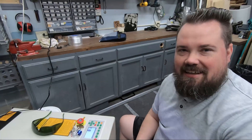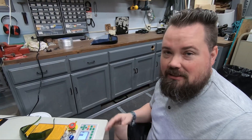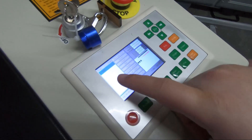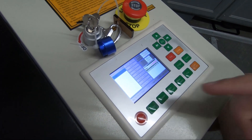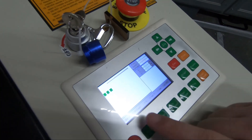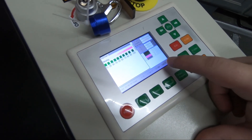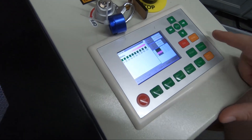Once you do get the DSP license, there are a couple of ways you can hook it up — we'll go over that more later. Right now I've just USB'd into it. I went ahead and sent a test file to it — it's the same power scale we always use, so I didn't change the speed or power. I just sent it to the machine. The cool thing is this machine can store files on it. You can have files saved to run multiple times — if you've got a particular file you're selling, you can send it and it'll always be on there without needing the computer. It shows you all the different layers, the speed and power of each, and you can frame it — works awesome.